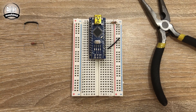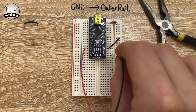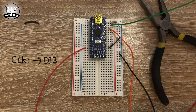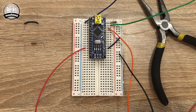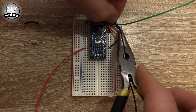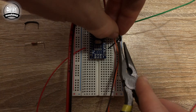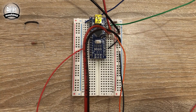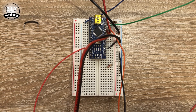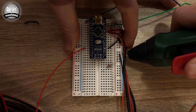Connect the LED display to the breadboard so that VCC is connected to 5 volts and ground to the outside ground rail. One wire from the arcade button switch should be connected to D8 and the other end to ground. The positive wire from the button's LED should be connected to D9 and the negative wire again to ground. Place the 2.2K resistor between the inside rail and one of the spare rows at the end of the breadboard. Use some hot glue to secure and tidy up some of these cables.